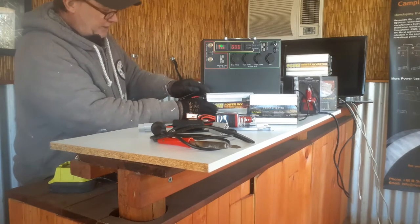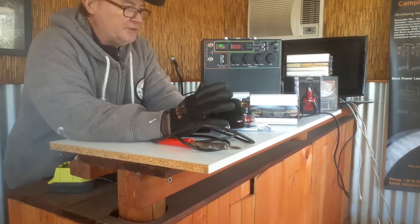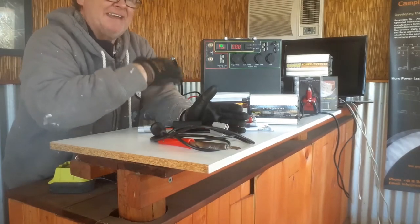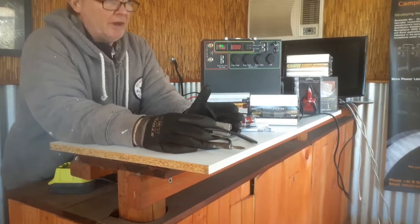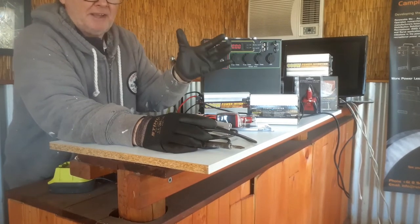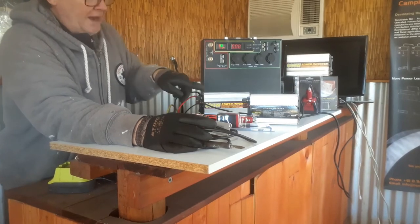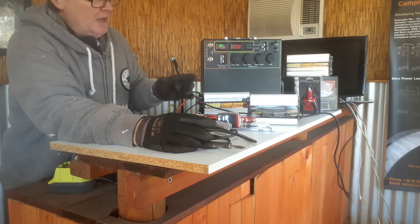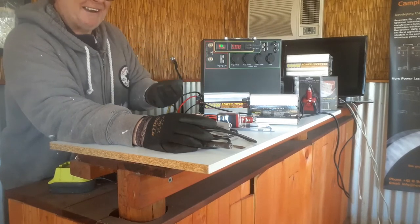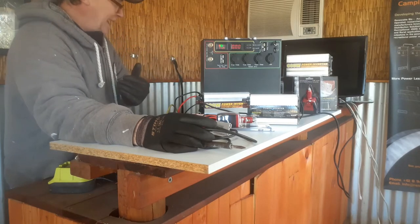I'm going to use a 600-watt inverter. When looking at inverters, check the products you're running with it. A 600-watt inverter can boost to 1200 watts — people say they'll work between the two, but don't do that. With a 300-watt inverter, it can spike to 600, and a 150-watt can spike to 300. Always look at the lower continuous rating. The reason for the burst rating is startup — a fridge, for example, draws more amps when it starts, then drops back down.